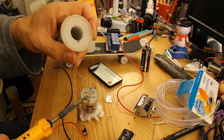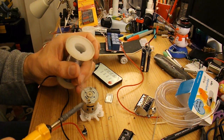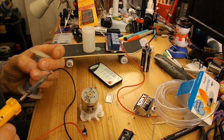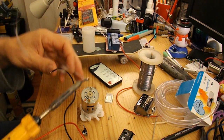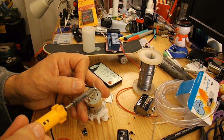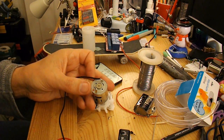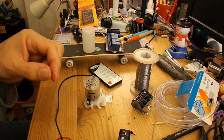You could wrap the wires round here, but I'm going to solder them. Tinning it first — tin all conductors. And then we're going to need a red one on the positive side.